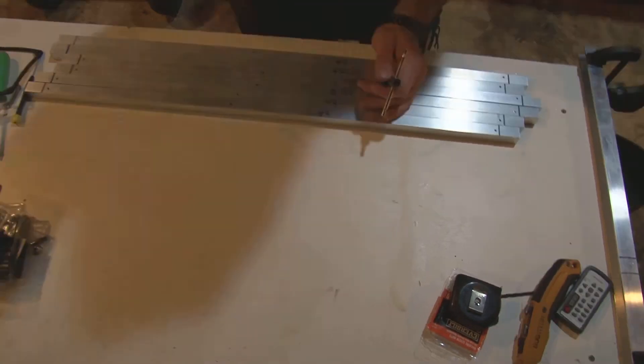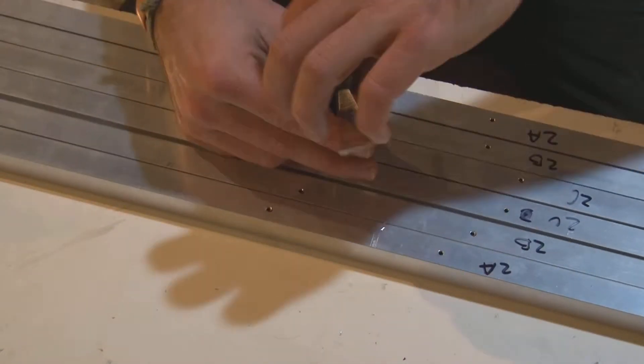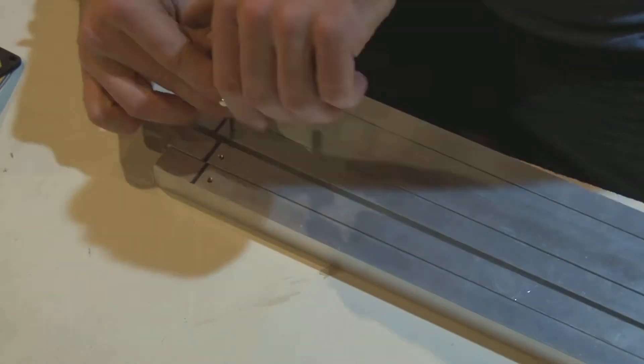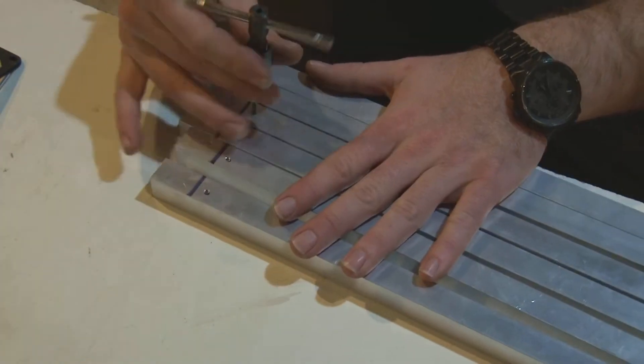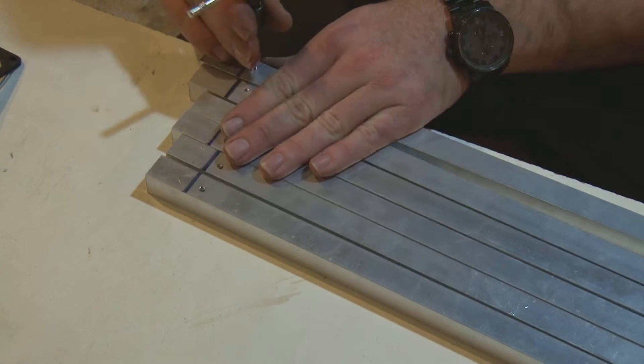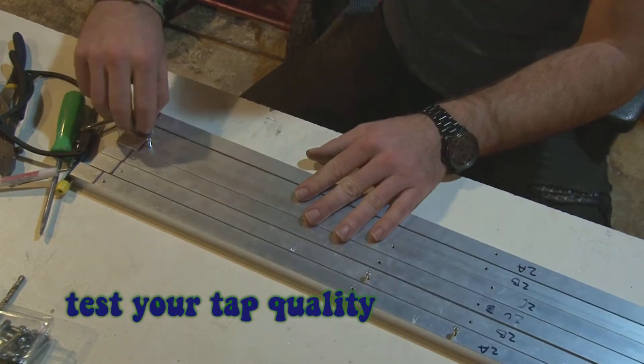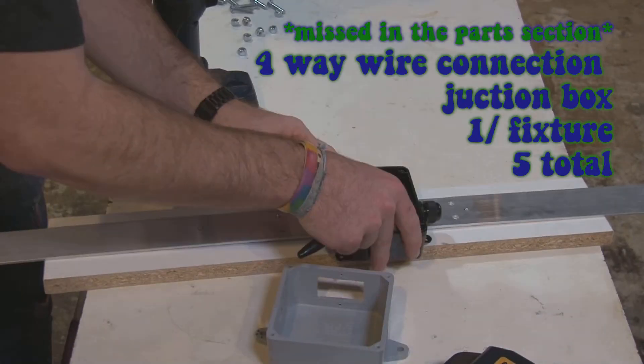I chose to hand-tap this part — you can just use a drill, that's fine, but I think the quality of a hand tap is better. I also know which ones I find questionable, and at the very end I can put a few screws in to make sure those questionable ones still fit. Once everything works out, we move on to the next step.